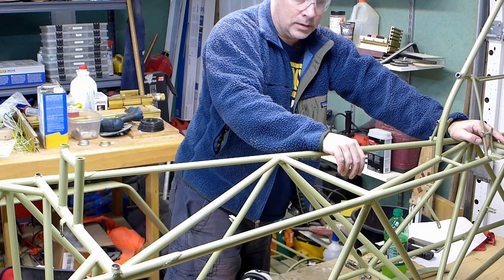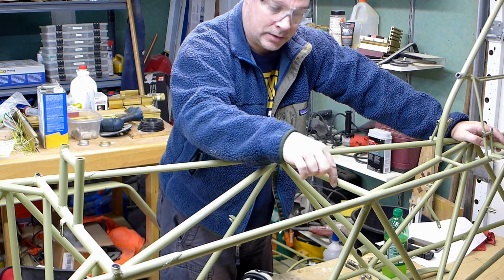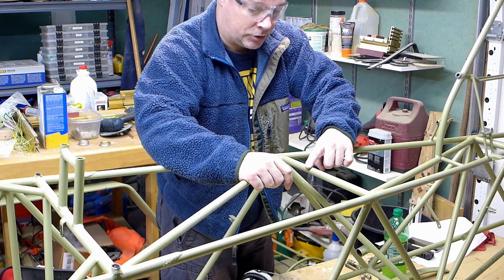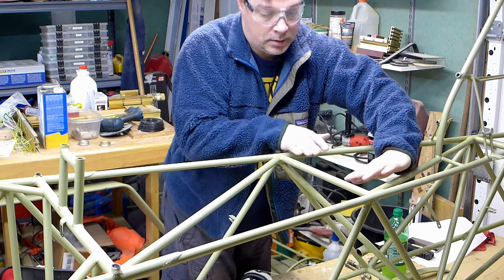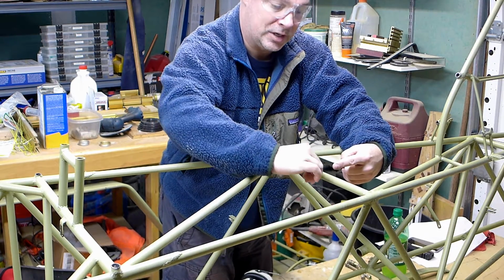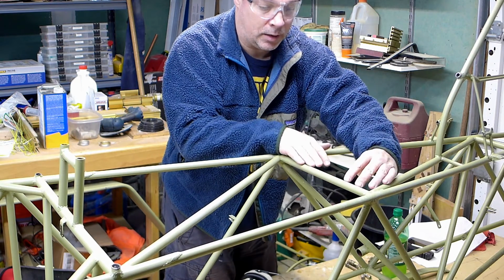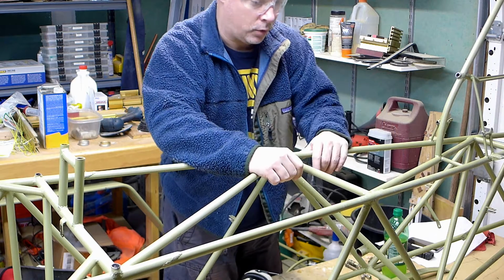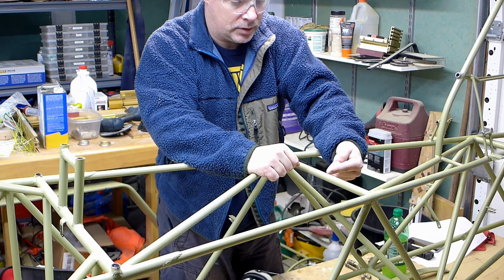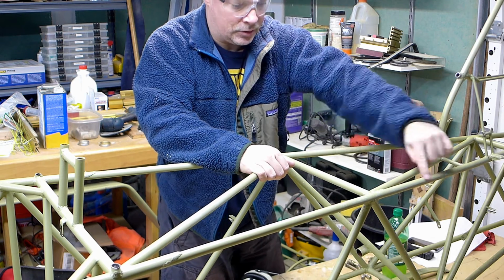Well, one thing I'll need to add is some tubes here like this that come out. The seat belt comes back and the two straps hook onto that. And there's a strap that comes here, a strap that comes here to provide strength in this direction. In case you get in a wreck, the seat belt pulls this way. This strap and this strap strengthen this area and help support it when it's got that forward force on it. Because a bar like this doesn't have a lot of support if you push on it in one of these directions. So those straps would be for that.